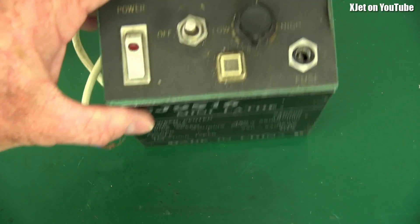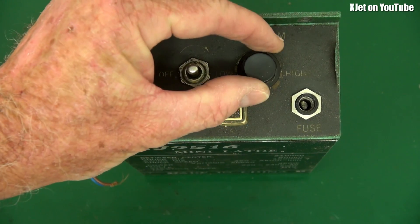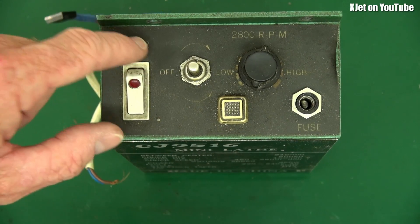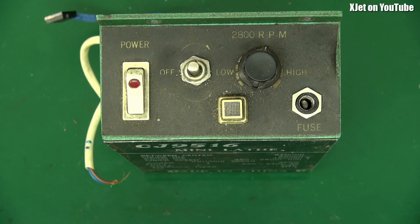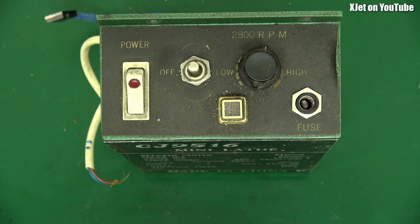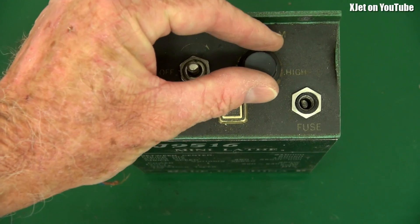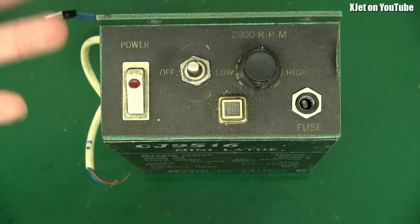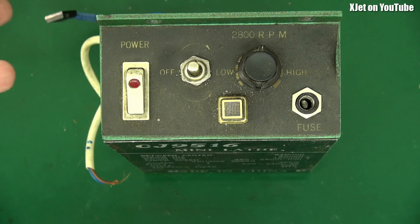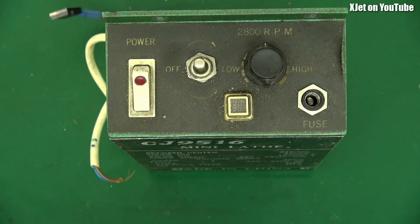Which means up this end here I'll have an LCD display. On that LCD display, you'll be able to dial up the RPMs you want using the knob, and above that will be the actual RPM — so you can see the lathe is spinning at the speed you want rather than the speed you think you've got. I'm not sure about touch screen, because that'll just get oily and stop working, so I'll probably keep a rotary knob for setting the speed and just an LCD. All it really needs is on, start, and speed — so there'll be room for an LCD. That'll be great.